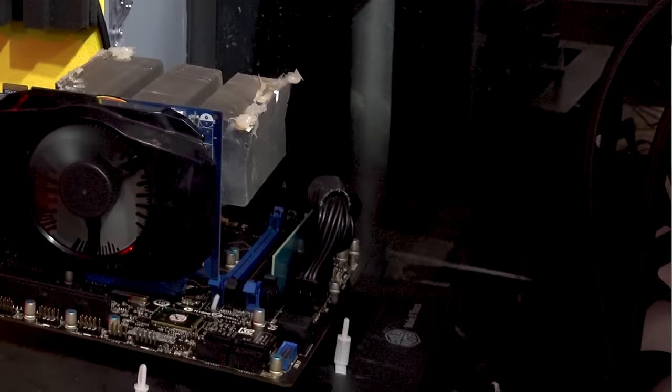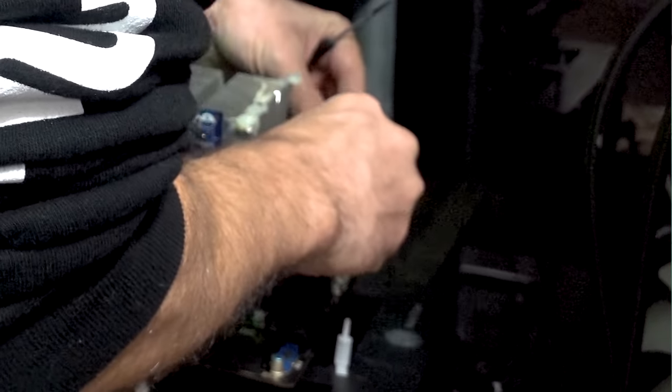In terms of the other two motherboards, the BioStar was just complete junk. It would just turn on and it basically wouldn't give out any signals at all. Tried different memory, tried different CPU, tried different slots, nothing. And then the B85 motherboard, we tried that as well, and that was booting up and then booting off in just this consistent pattern. And the good thing about that was I could play musical chairs with the RAM, in that every time it booted off I could quickly change the RAM slot without having to turn anything on and off again, just to test the board out and see if it was total toast.